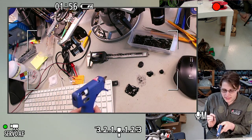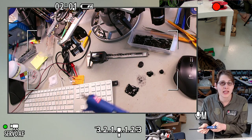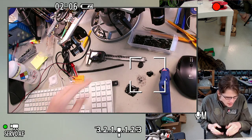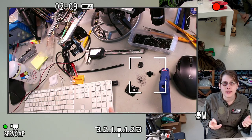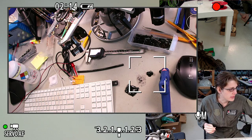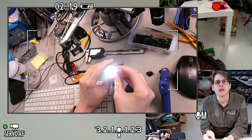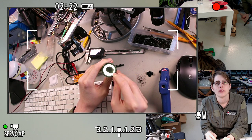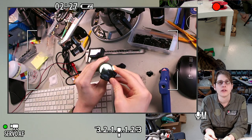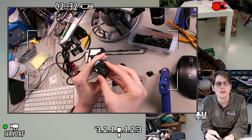Oops. I've got this in a different hot glue gun because you have to purge it through to get all the pigment out, because this is really heavily loaded with pigment, it turns out. Because of that, it's very densely pigmented. You can use it as light insulation pretty effectively, and it's non-conductive, unlike using foil for light insulation. For example, that's a thin little puddle of this stuff and a pretty bright flashlight. Here's a bigger piece. And you just don't see any light through that. It's very heavily loaded.